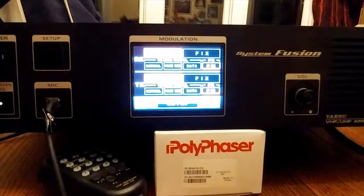If you have an analog radio and you have tone decode turned on, you're already ignoring all of the digital noise. And if you have that on and your CTCSS tone drops before your carrier, your radio will mute your audio and you will not hear the carrier squelch crash after the repeater stops transmitting.